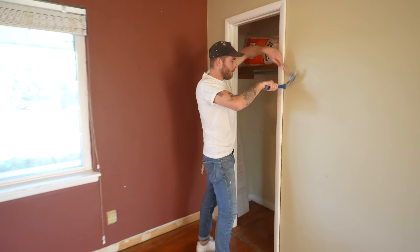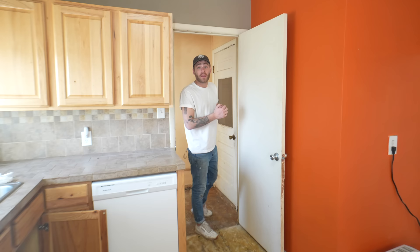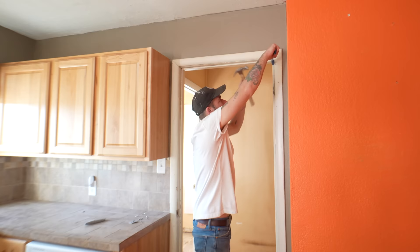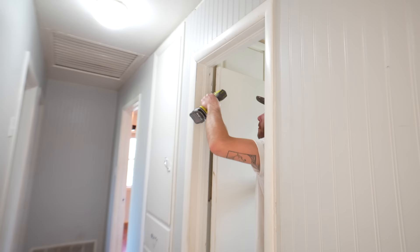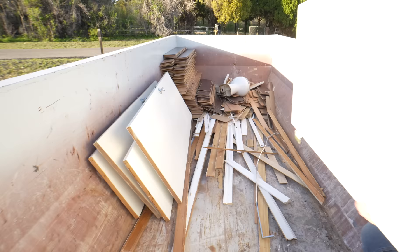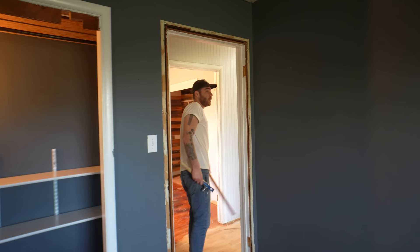It's really good practice to use a utility knife and cut between the wall and your trim so you don't peel away that paint. I don't think I'm going to be putting a door back here — I'll probably tear out this whole portion of the wall. I've been using a small trim-pulling pry bar and it's been working great. Make sure and wear safety glasses. The doors also don't look terrible on camera but they are very rough — between about a thousand layers of paint and damage towards the bottom where the wood has been chipped, I figured I might as well throw them away.